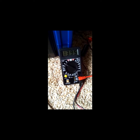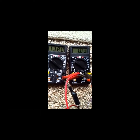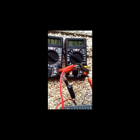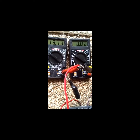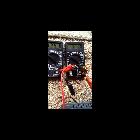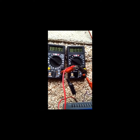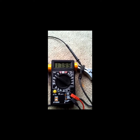We'll now turn off the lamp load and see how long it takes to settle. The voltage from the controller jumps to 14 — 14.1 is about the right number for a gel battery. You can see the battery is starting to recover right away, so the charge controller starts to back off. Looking at the charge controller itself, you can see 13.8 with 1 amp flowing, and that current will slowly drop to the trickle current of about half an amp seen at the beginning. The system goes into a standby mode with a float voltage sitting around 13.6. The output from the car charger jumps back up to 18 because there's not much of a load on it.